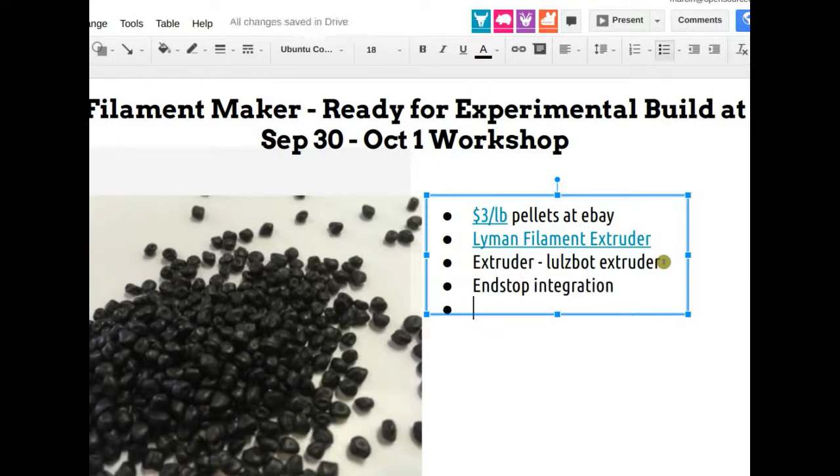The third improvement: I've got nichrome wire and fiberglass sleeves to make our own heated beds. For this workshop round we'll offer 12-inch beds — a steel or aluminum plate with shielded nichrome wire underneath. It's a relatively quick demo: put the fiberglass sleeve on the wire, plug it into a wall outlet, and it produces about 800 watts. We'll use an external relay driven by the RAMPS controller instead of controlling the heat bed directly from RAMPS, because it's more power than RAMPS can handle and the controller keeps burning out after about two months of testing.